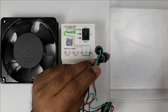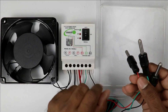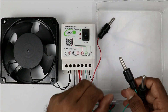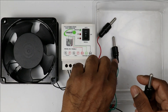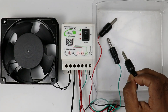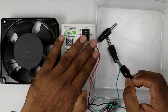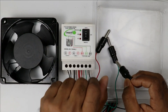Now take all three sensors and place them inside the water tank. Connect the red sensor at the bottommost surface of the tank. After this, take the green sensor and connect it at the middle of the tank — at the center position. The black sensor should be connected at the position where, when the water level reaches that point, the motor must turn off. Place it somewhere below the topmost point of the water tank, leaving a gap of some inches below the top.